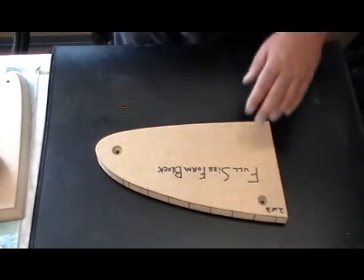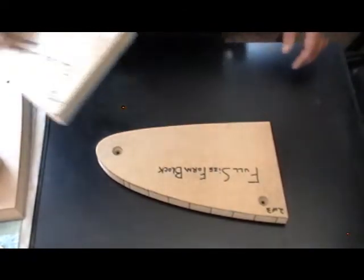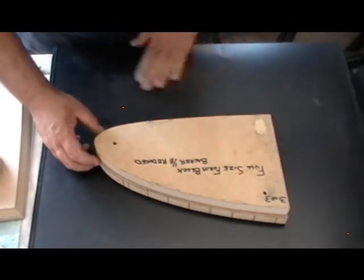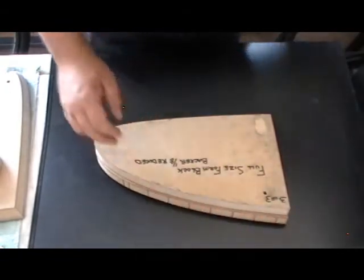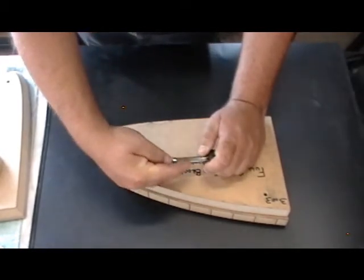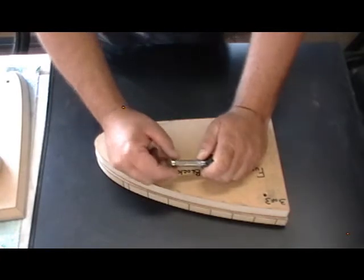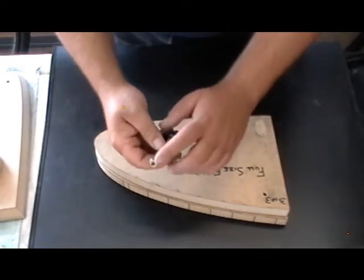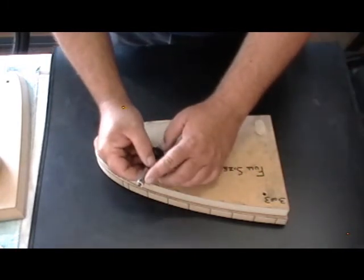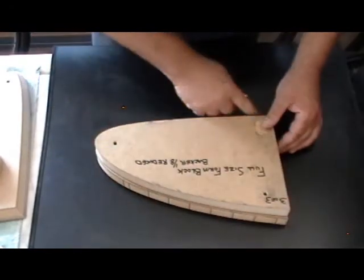The first thing I want to do is copy this, so I make a second one basically the same way as the first — now I've got two exact copies. Then I take that second one and reduce the edge by one eighth of an inch. Briefly, that's so I can get my hammer in here and set the edge of my rib. I do that using the same router bit but with a smaller bearing — now the cutting surface sits about a sixteenth of an inch proud of the bearing. After a couple of passes I'm reduced by an eighth with a perfect one-eighth relief all the way around. That's my backer.